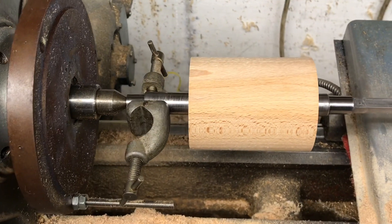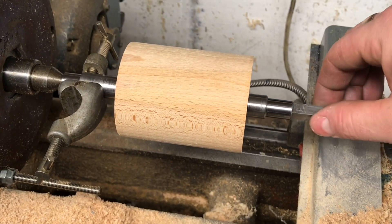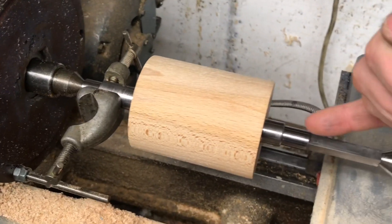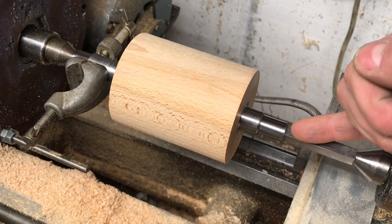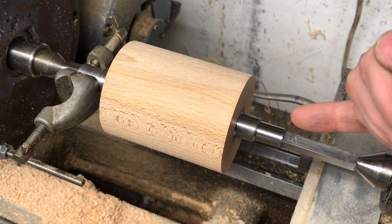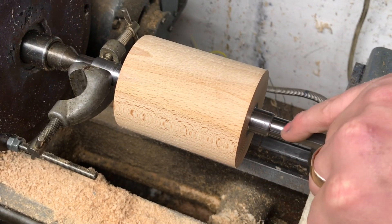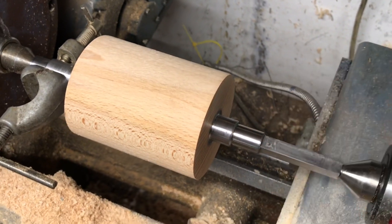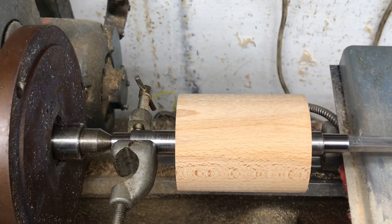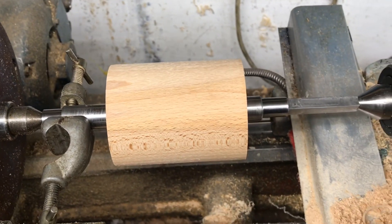I've just finished the arbour and the barrel. I still need to polish up the turning square, but I have properly polished the pivots. I used a standard fine file, then emery paper, then a super fine pivot file, and then a burnisher, which has brought it down to a pretty mirror finish. I'm quite happy with them — I don't think I could personally polish them any more, they're pretty shiny. That now is the barrel complete. I just need to give an oil to this piece of beech and then we should be good to move on to the next components.